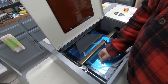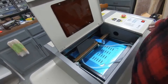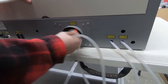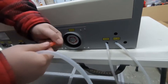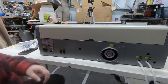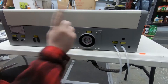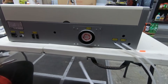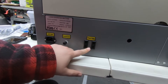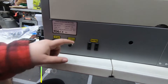Looks like everything is covered with a nice protective film. Let's go to the back. The tubes are just stuck in and held together. These will go into distilled water — we want distilled water in a bucket and we will use that pump to water cool it. Smoke outlet — just a little computer fan looking thing. I'll probably build something to connect into our bigger exhaust hose. Water in and out, water pump hookup. I'm assuming you plug it in here and it'll turn on the pump when you turn on the machine. Grounding wire jacket — I don't think we need this because we are grounding through here, but I will read and see on that.